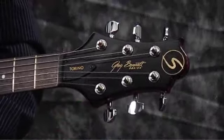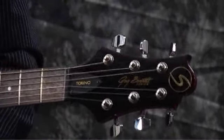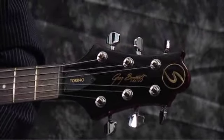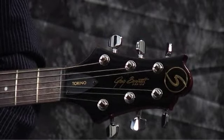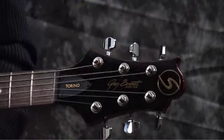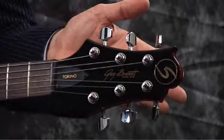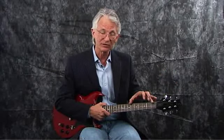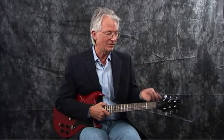Our offset design headstock, we're really proud of. That's a big part of our brand identity, but the headstock also offers you a tremendous opportunity to create some mechanical advantage and improve string performance — things like attack and sustain — simply by how you design the headstock. You'll notice that most of our headstocks are a bit smaller, and that reduced size reduces the resonance surface of the headstock. What that means is if you have less resonance up here, you're pulling less energy from the string, because anything on the guitar that's moving is taking energy off the string. So you can actually pick up a bit of attack and sustain through this.